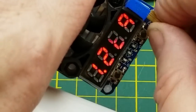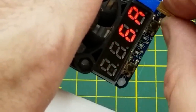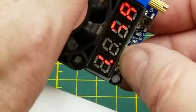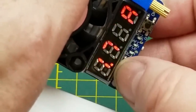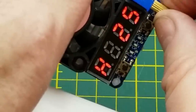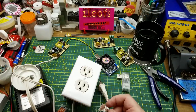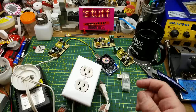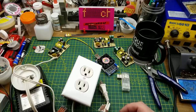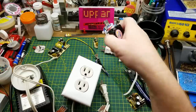With the load connected, it's pulling 1.09 amps and the output voltage is still 5.1 volts. It works just as well on European voltage — and it kicks out right there, which I expected. I'm not going to leave that connected any longer than I have to, just to prove it works on universal world voltages. I'll clear this dangerous setup out of the way and move the wiring over to the next power supply.